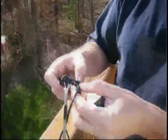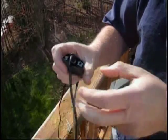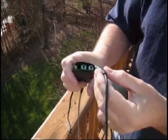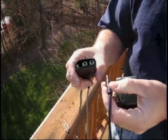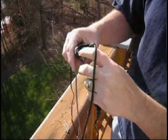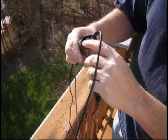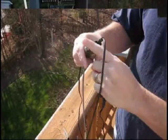Back to the audio adapter — here's your power in, and here's the audio inside. This jack is for an 8–16 ohm input, and this jack is for line in. The line in can be anywhere from several hundred ohms all the way up to 100,000 ohms. The audio gain is a plus or minus 6 dB adjustment, and when the flat is straight up, it's at nominal gain.